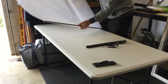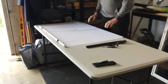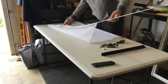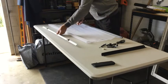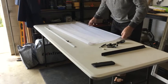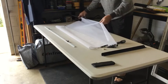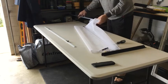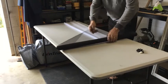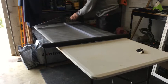Now place the screen on the bench and remove the two plastic guides on the end of the aluminium strip. This can be achieved by carefully levering them off with a screwdriver. Slide the screen out of the guide. Remove the round metal spring-loaded roller in the same manner. Simply remove the small plastic end cap and slide the screen out. With the screen on the bench, you will see two round plastic rods stitched into the end of the mesh. Remove these. They will simply slide out.